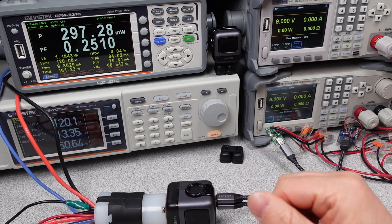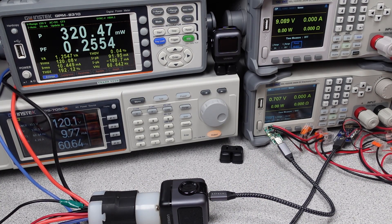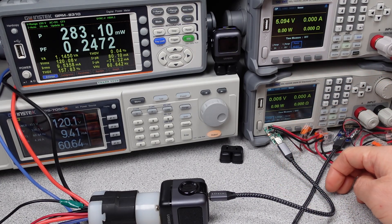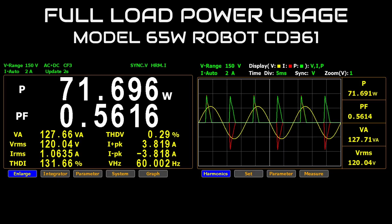So how did the CD361 do? The voltages look good, the ripple looks very good, the efficiency is very high, and the power quality score is on the lower side but perfectly acceptable for a device in this class. I do leave out some things covered later, like overall and idle power usage, but those are still present — just consolidated. This adapter did not meet the DOE 6 requirements. For advanced users, here is a screen capture of the data at full load.